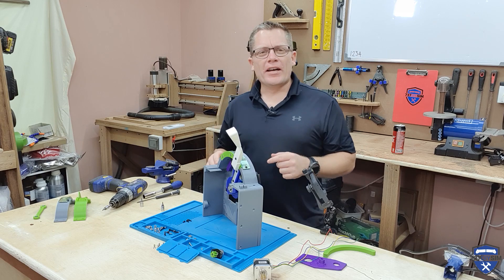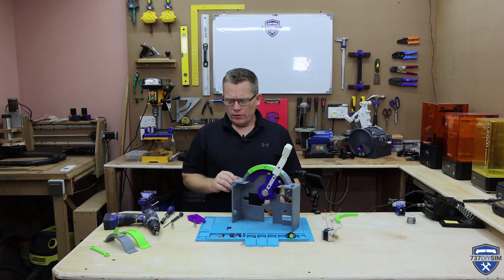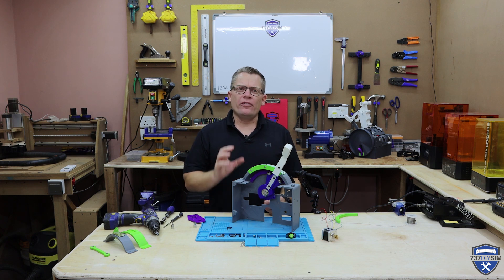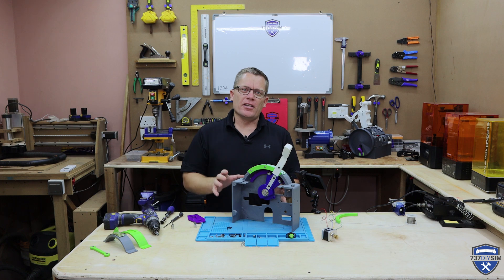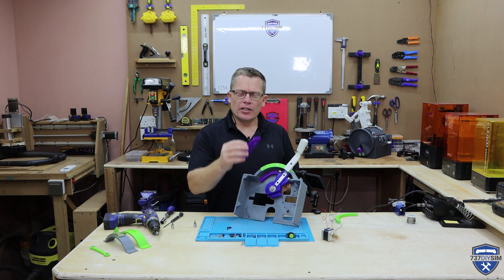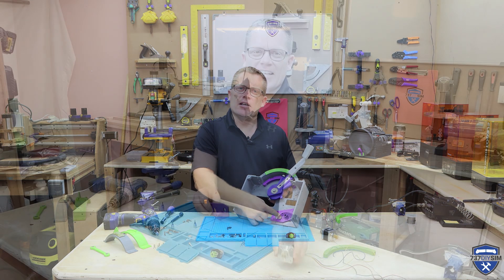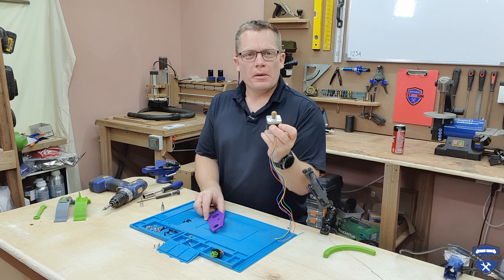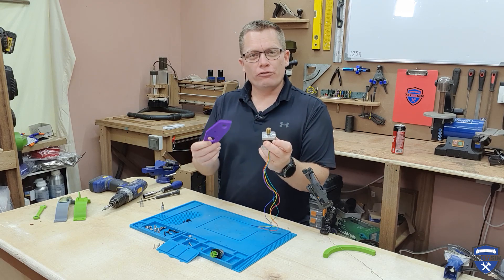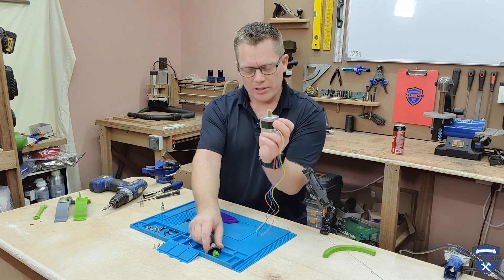On to the next part, and that is to replace the servo mechanism with the stepper unit. What we can't do is check the fit of the stepper mechanism for the speed brake using this part here. So what I've done is I've redesigned it on Fusion — I've just cut out this single section here and this is just to check the gear meshing of the three units. We've got a mid-drive unit, we've got the hall sensor, and we've got the stepper.